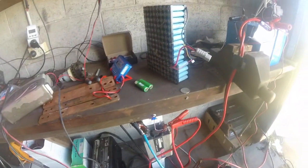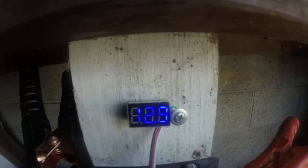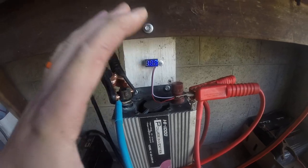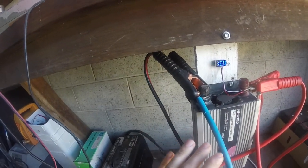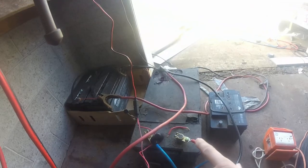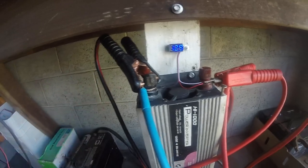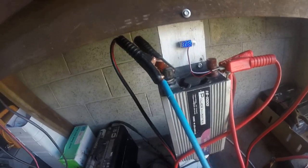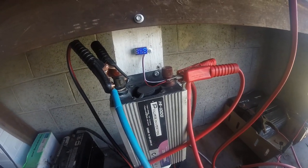It actually needs a bit of liquid in it. Some new additions: I'm going to put this little voltmeter on the back of the inverter so I know what voltage the back of the inverter is getting, regardless of what the leads are doing. That big dozer start battery is actually connected straight to the inverter, as are the two up the top, so we get less voltage drop. There are three sources of power going straight to the inverter from each of the batteries.